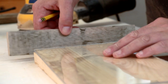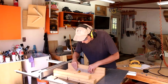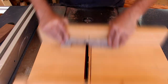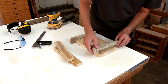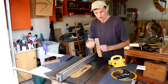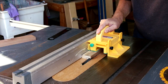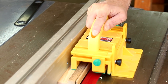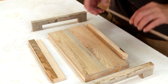With the plexi in place, I want to make a mark where these end pieces get notched out. This should fit nicely over the plexiglass and that board. I'm going to use a stack of dado blades to cut rabbets along one side of the top and bottom pieces. And I'm trimming a little bit off the lower piece. The final piece I cut was this little strip that will create a ledge for the marker to sit in.